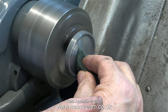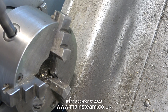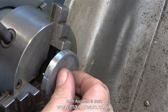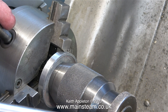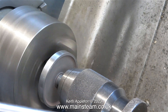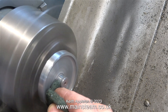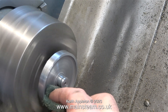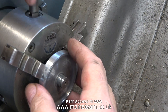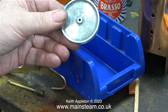To clean the flywheel properly it's now in my Myford ML7R's chuck. I used a piece of scotch brite to clean up the front and outer edge. Turning the flywheel around to do the other side, I have to hold it in the chuck by the rim. To centralise it I use my normal method of the tailstock chuck, which means the flywheel is now running as true as it can. Once again I'm using scotch brite to key the part for paint, being very careful not to catch my hand in the chuck. It's a serious warning — even a small lathe like a Myford could do an awful lot of damage to your fingers. This flywheel casting is really horrible; I don't think the aluminium it's made from was very pure.